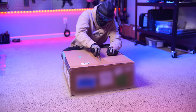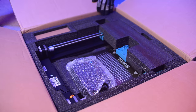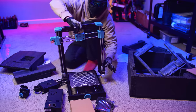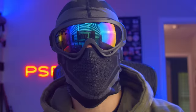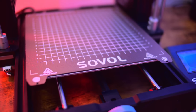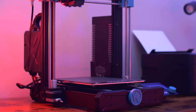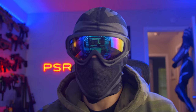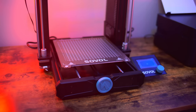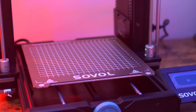So what was it like to put this thing together? It was super easy — basically about five or six steps. It comes with the gantry and the base, and you just bolt them together with four bolts. On a difficulty scale where 10 is really difficult and 1 is not difficult at all, it's maybe a two. If you're intimidated by assembling a printer, this is definitely for you. The build volume is 220mm by 220mm and 250mm on the Z. It's got injection-molded parts and extruded aluminum, and it felt very solid — not cheaply made or wobbly at all.